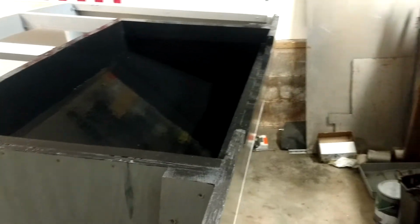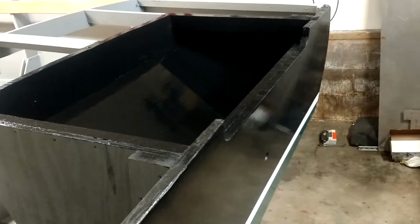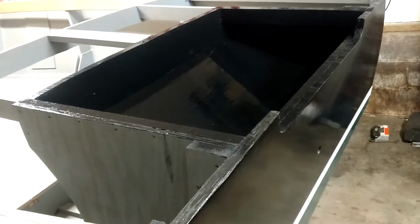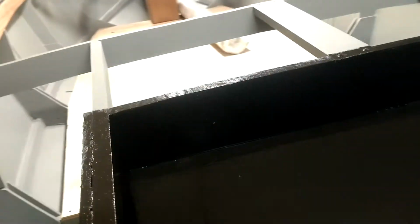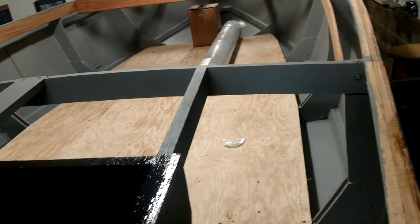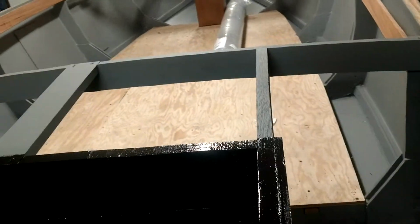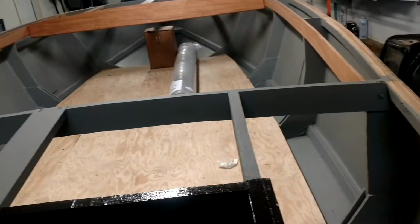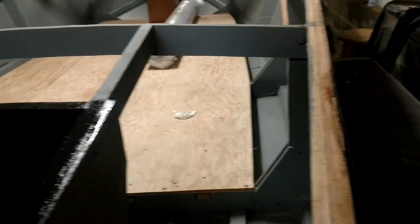And it's kind of cool when you put this boat together. I was first a little bit skeptical about putting a big outboard on this thing. I thought, God, to hang 230 pounds off the back of this and then go power around, I mean, that's a lot of weight for a plywood transom. But then you look at all this structure the plans have you put in with a strongback and these battens and all that stuff, and you can kind of see how energy really gets transferred efficiently throughout the whole hull, on the top side, along the floor, on the bottom, through the frames, the shears, the chines, all that stuff. So it's really cool engineering, I think. Teaches you a lot as you're putting it together. It's been really a fun project.